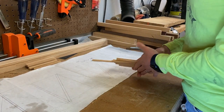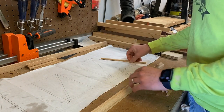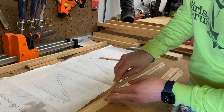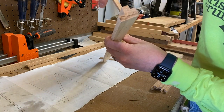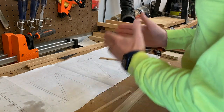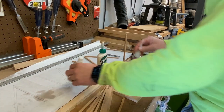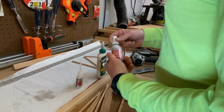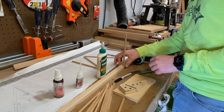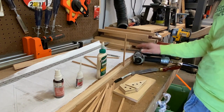We've got all pieces cut to their proper length. Now we begin laying this out as each side would be. These quarter-inch pieces are going to fit right into the slot on the main beams, and we'll need to cut some angles on them so they all fit up nicely for a good joint. I've got wood glue, CA glue, and some CA accelerator — the rapid zip stuff that locks it up right away. I'll apply wood glue on the first upright piece, CA and zap it to hold it in place, then tack it with a small brad nail for strength.